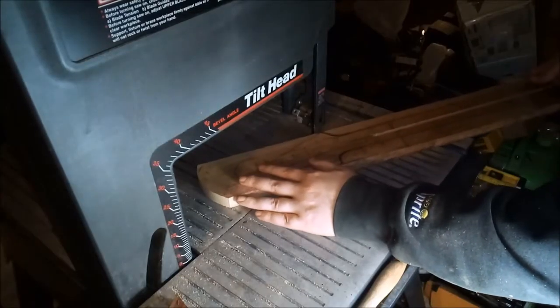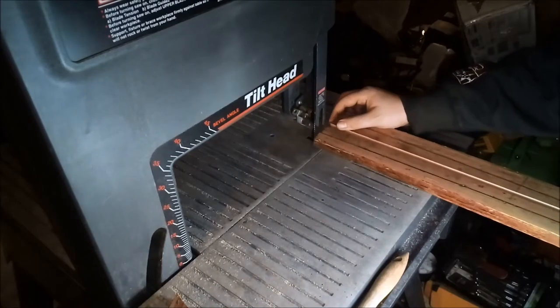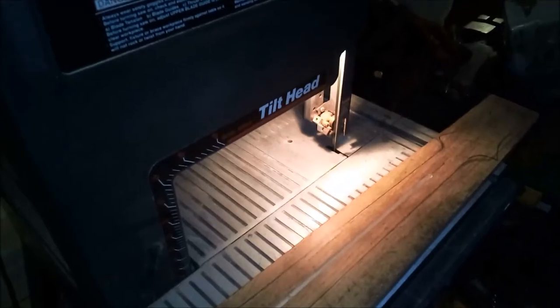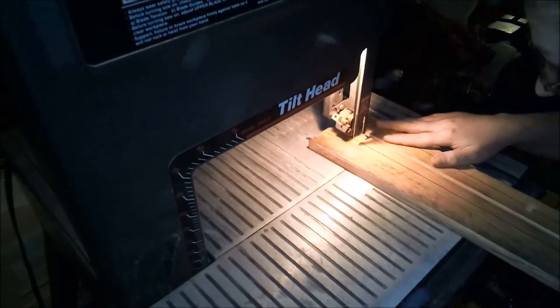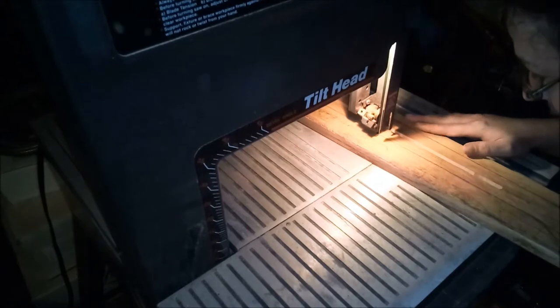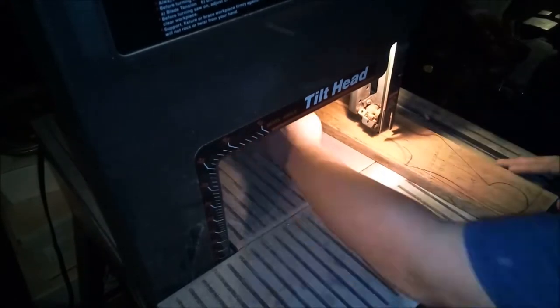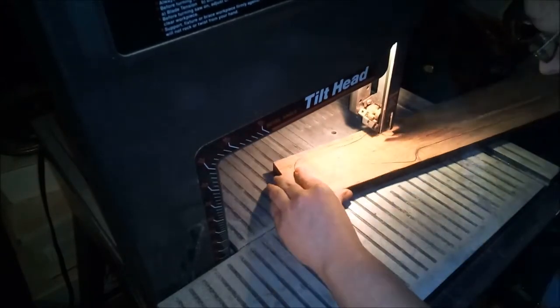It's time to sit up at the saw and cut this thing out. If you don't have a band saw, don't worry — you can do the same work with a thrift store jigsaw or a cheap coping saw. I was just about to make my cut and the camera switched off, so I made a whole other neck blank. The headstock looks scary, but these straight cuts are the hardest. To build guitars you really need a 12-inch band saw at least. I got this saw on a great deal from Facebook Marketplace, delivered to my door for less than a Harbor Freight 9-inch desktop saw with a coupon.